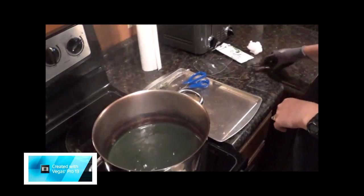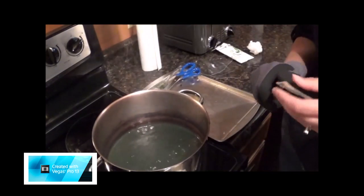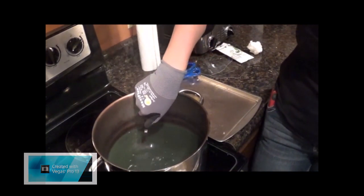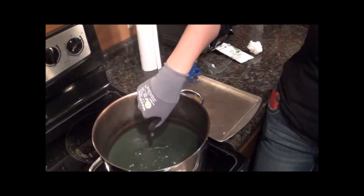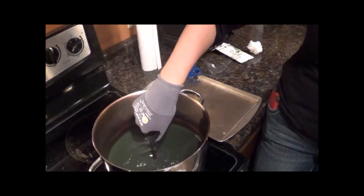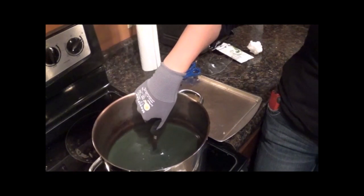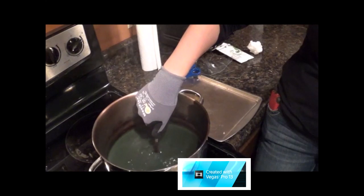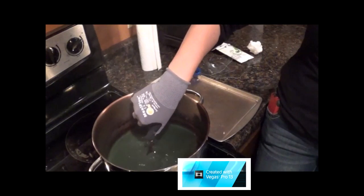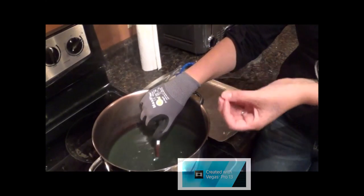Gloves on, little bit of scrap, firm grip on the plastic because it will kind of float away from you, and then we're going to submerge it. Because it is a thermoplastic, it loses all of its stability immediately — all the stiffness is gone. It's pretty much just turned into a really soft piece of plastic. The integrity is completely gone. That's why I like to keep a hold on it — I don't want it bashing around inside the pot. You can let go and hope the bubbles will keep it up, but if you walk away it might fold over and attach to itself.